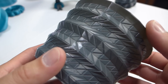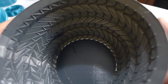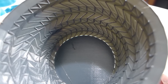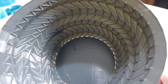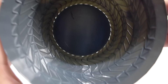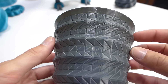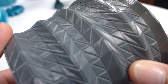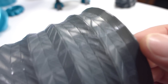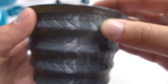The bowl in the gray looks fantastic — really, really nice print. The only problem you can see down the bottom is there are some holes. It did not extrude that bottom bit quite properly, so there are some holes down in there. It definitely is not watertight, but it does make for a good bowl still — a candy dish or whatever. It looks super duper nice. The resolution was great at 0.2 millimeter layer height. You can see the layers in it a little bit, but it still looks like a fantastic bowl.